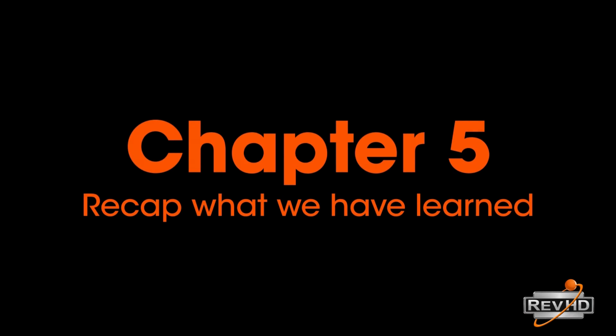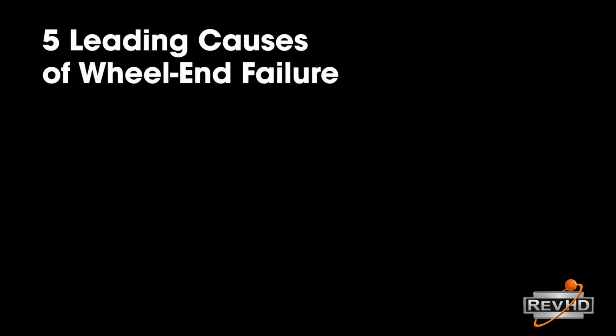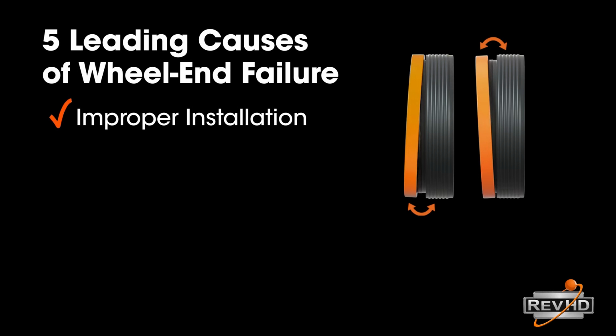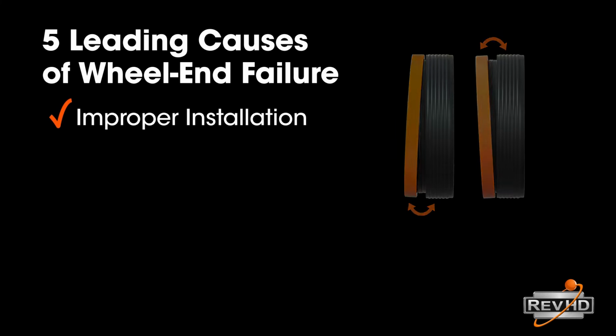Chapter 5. Let's recap what we have learned. Remember, there are 5 leading causes of wheel end failure. 1. Improper installation. The top plate of the RevHD seal is the tool and can be installed by any flat, clean object. This same top plate tool continues to protect the seal while docking the hub and after the vehicle leaves the shop. Our unique flex design will also help protect you against cocked seals.